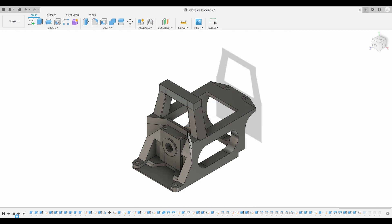Now I was confident to print the final piece in the right thickness with the right material — which is a bit more expensive. I used the X-PLA. It's not to be confused with regular PLA; it's much stronger. I used nine perimeters and about 50% infill, so this is a real sturdy piece.